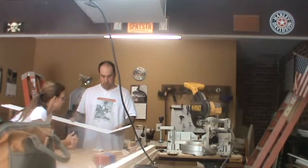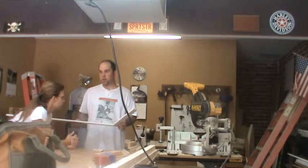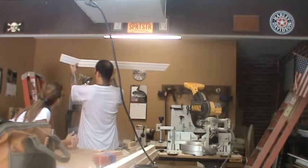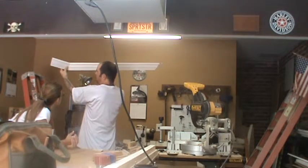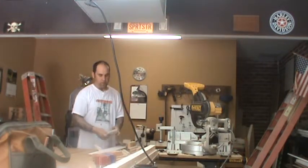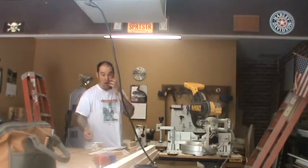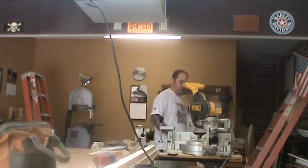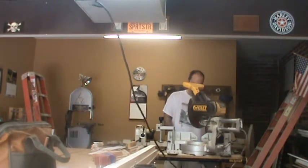Oh, okay. So it's standard in building, the angles that they build for your walls. So that would be up on the wall like that. So it's more like on a tray ceiling where you have an octagon or a hexagon. It would be used for that. Okay. And those are the trickier cuts. A lot of people usually do them at 45 because it's simpler for the carpenter. But in the really expensive homes, you're going to have a lot more 22-degree angles and 30-degree angles, probably even some that are more or less. What else?